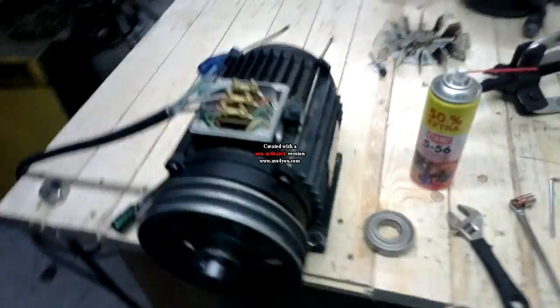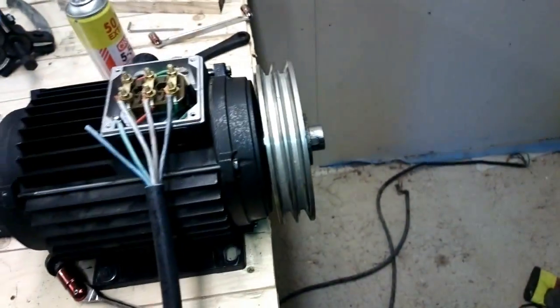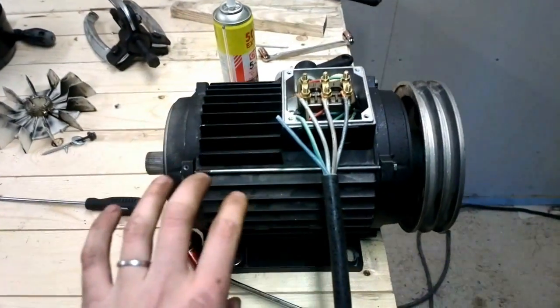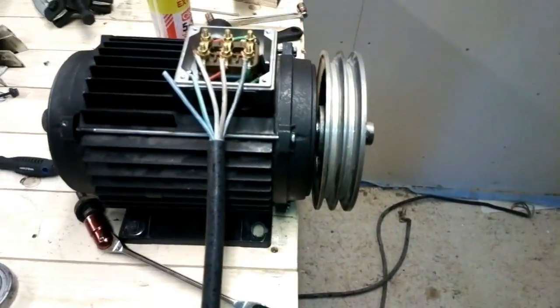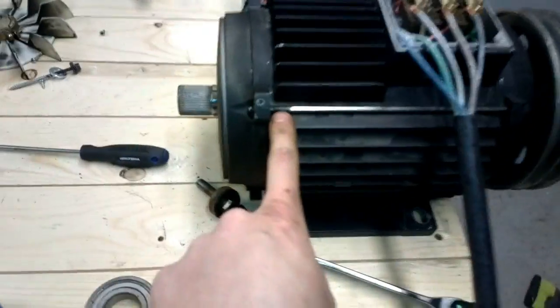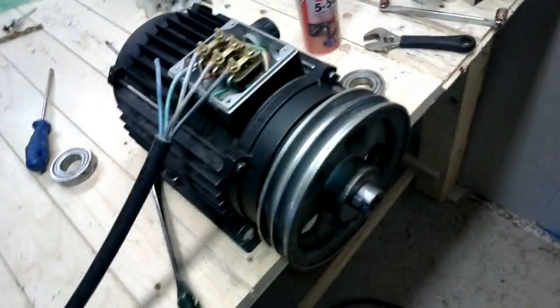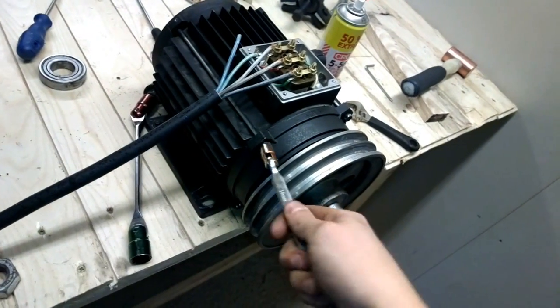Things are starting to look pretty good now. I first slid the shaft back on, and these bolts were not quite long enough to reach from here to here. So I used my copper hammer very slightly on this end cap to get it started about five millimeters on this side. And that was enough for these long bolts to reach, so I could use them to pull the motor back together. I just used a wrench, one bolt at a time, very carefully.